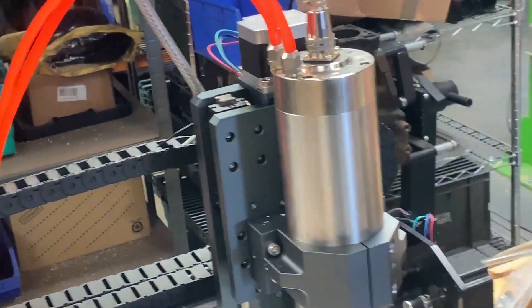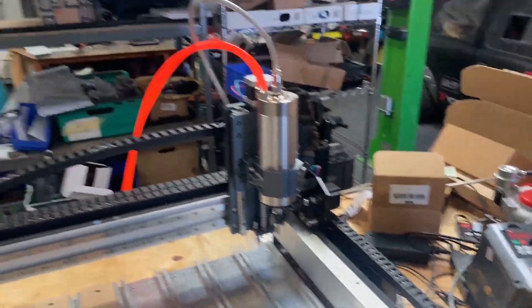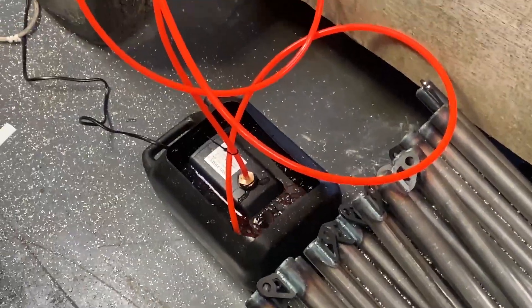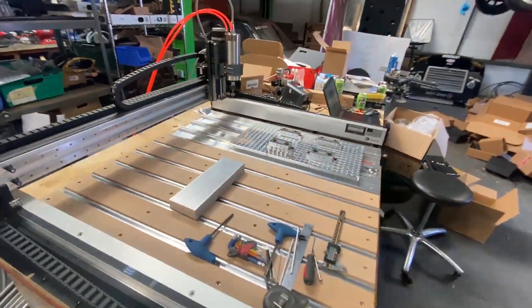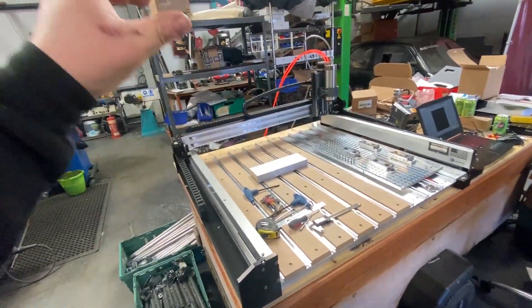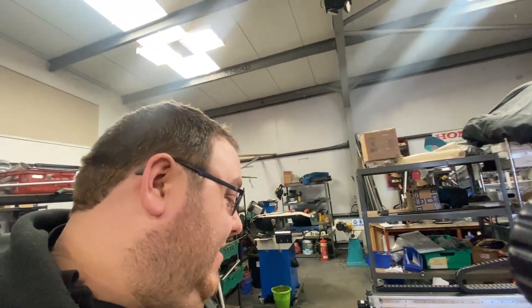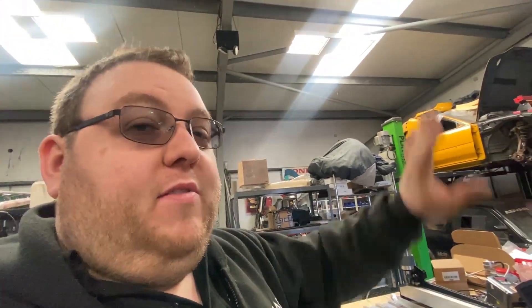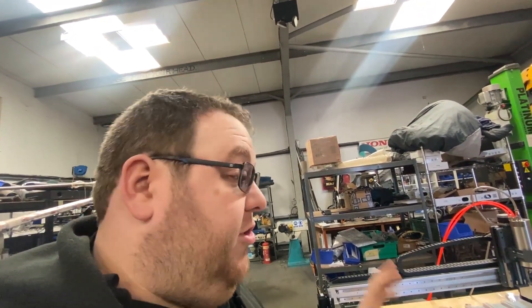I've literally just really crudely wired the spindle and the VFD up on the table here, and for the water cooling we've just got a 5-litre tub that I've cut open and cable tied the hose in there. It is very crude just because I'm really excited to actually do some machine work, but the plan will be to design a proper enclosure. I already did a bit of work yesterday after the video montage and the aluminium chips went absolutely everywhere. Chip evacuation was going to be a thing, but I didn't think on such a small machine it was going to spread that much.